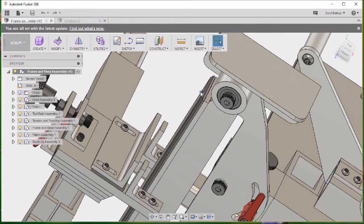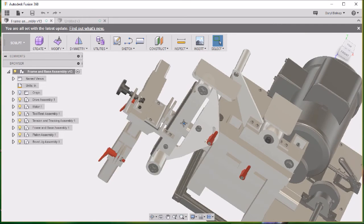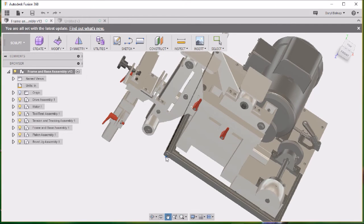And what I'll do is I'll get a lightweight belt, something thin and real flexible, and I'll roll it out. I'll use the tracking wheel to move it out over here past the edge of that, so when I come in, the belt will kind of roll around this radius a little bit and give a blended sanding at the ricasso area. That's an experiment. I hope it works the way I think it should work.